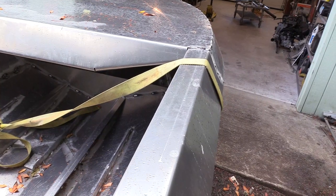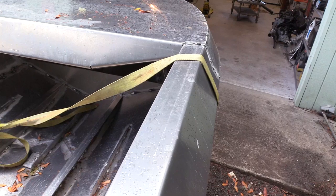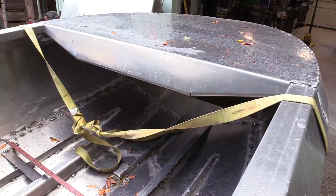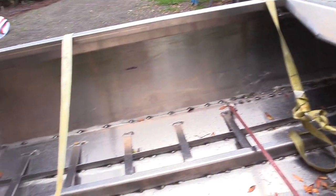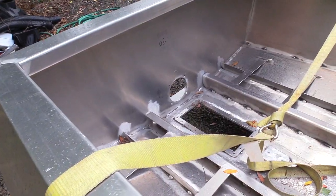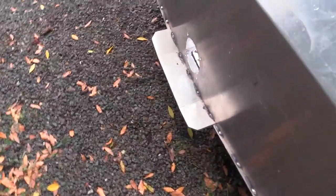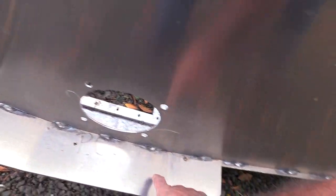But that's not the worst problem, or the core of my 1-inch rise on that end of the boat, on that side of the boat. The transom is level with the keel. I had the keel rebent because I had that 3/16 gap back here. Between here and here I had a 3/16 difference from side to side, with the left side being lower.